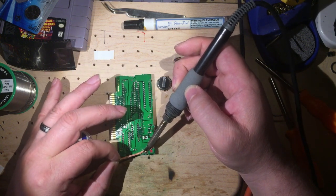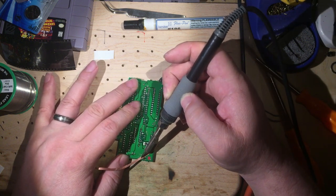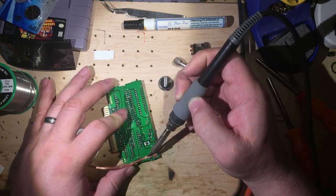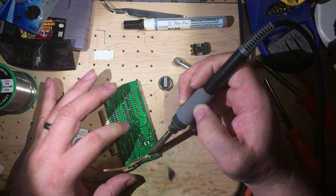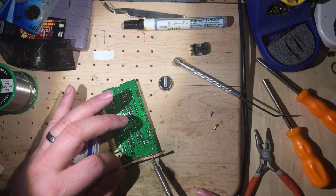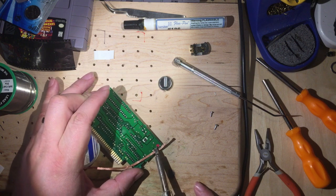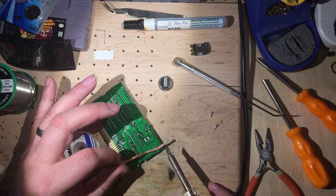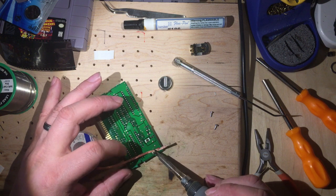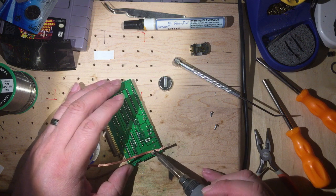And so, if it's not working or not falling out, just double check. You may need a hotter iron. My iron, I do not remember if it's Fahrenheit or Celsius. It only shows a number. It doesn't indicate which temperature range, but my number is 750.